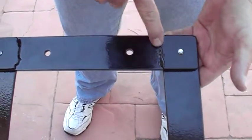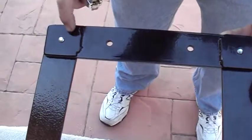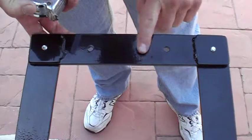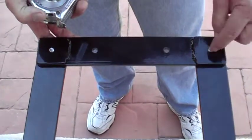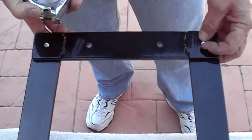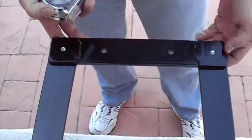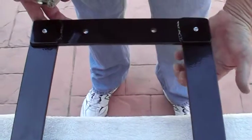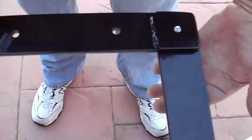I added an eighth-inch thick piece of mild steel right out here on the ends because I threaded this plate. Right here this plate is threaded because I couldn't put a nut on here — that rear bracket that this bolts to has some clearance issues. If you drill through this whole thing to put a through bolt, the nut is going to be in the way of the motor mount bracket. So I threaded this plate, and the bolt slides through from the bottom. It's a clearance hole in the bottom plate and this one's threaded.